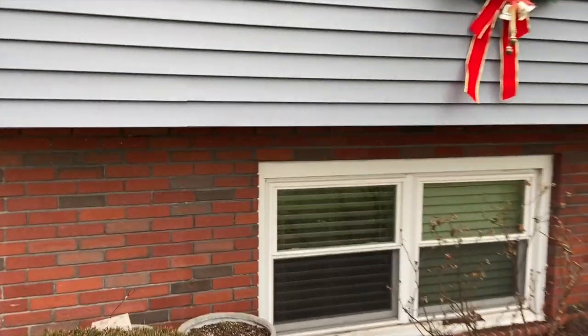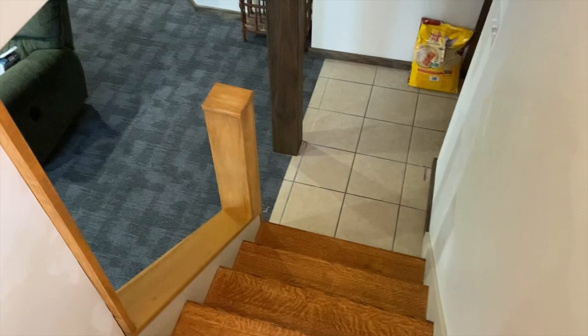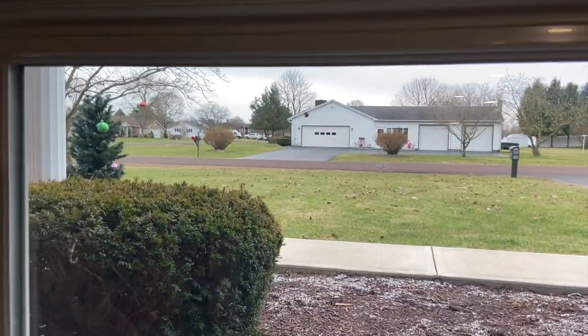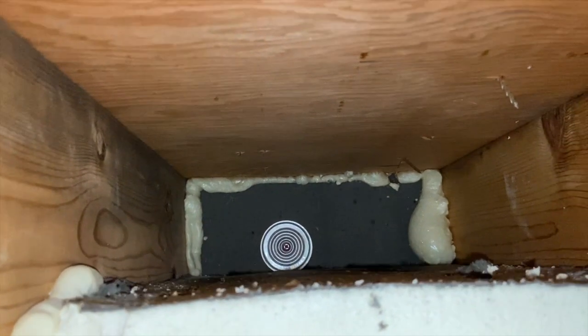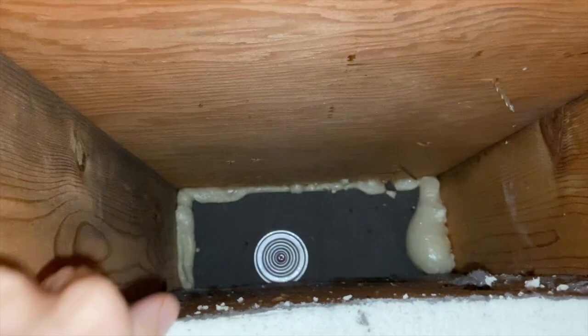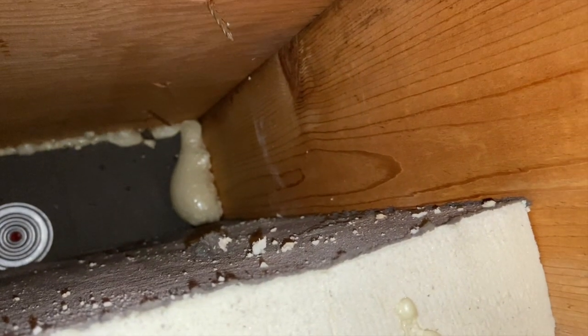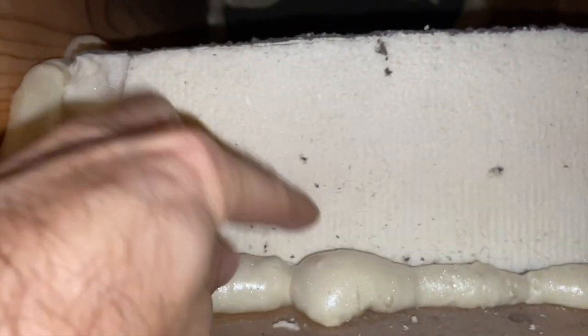I live in a bi-level house. If you live in a bi-level, you seem to lose a lot of heat up under the overhang. Go down in your basement or living area and look up inside between your floor joists. All the way at the back of that overhang, I put a piece of insulation board and I put spray foam up around it. Then at the bottom I put another piece of insulation board and spray foamed around that. One side was tight so I left it, and when I put spray foam over there it tightened it up. That sealed them up real good.